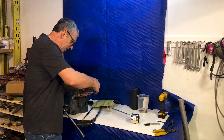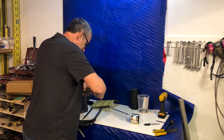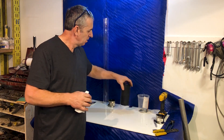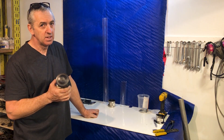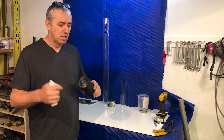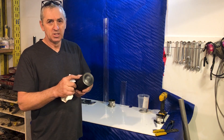I've got it all cut. Now I'm just going to clean up the acrylic — it actually melts when you cut it, which makes it a pain to cut. The next part is the tricky part: we're going to machine end caps out of this piece of plastic. If you don't have a lathe, it's okay. What I've done in the past is taken flat plastic, as thick as you can find, and used a hole saw to drill out a disc, then do the same thing with the disc as we're going to do with the machined part.